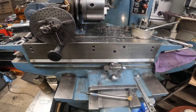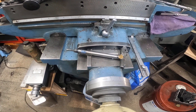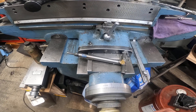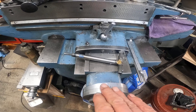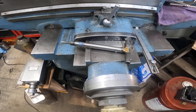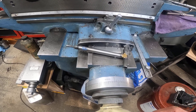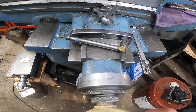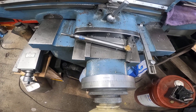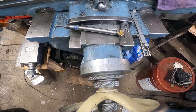Another thing I'll show you is these screws in the table are high precision. You'll see this arrow right here — they're only precision in that direction. That's for positioning, and these screws are still accurate in this old machine. So when I was milling, I was going the opposite direction of the arrow, putting the thrust on the non-precision side of the screw. They're made in the basement at Moore, from what I understand. The Moore company makes the most accurate screws in the world — there's just no doubt about that.